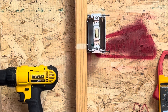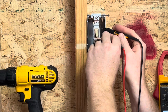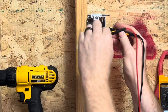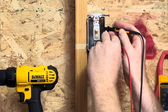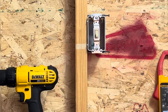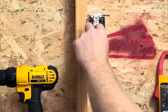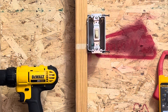We're going to go from gold to gold — nothing. We're going to flip the switch up and we got continuity: 0.1 ohms. So that tells me that single pole switch is good. If you were to not read anything between the two gold screws by flipping the switch, you've got a bad switch.